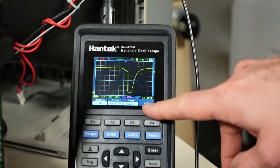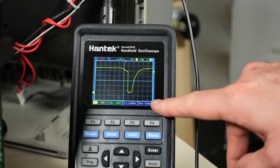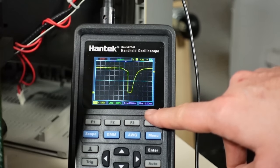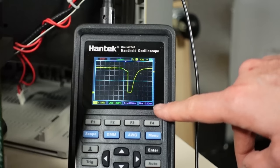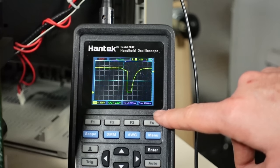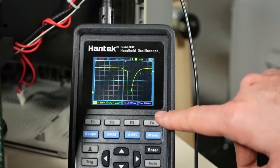That is the reset chip resetting the microcontroller. That, right there, that's gotta be the problem. There's gotta be an issue around the power, around that little reset IC. And it's causing the whole TV to not start.